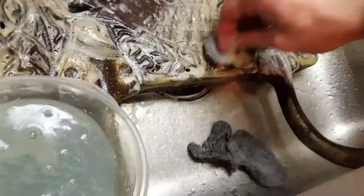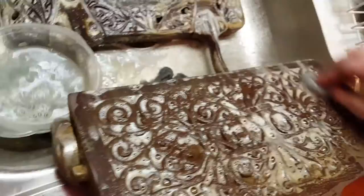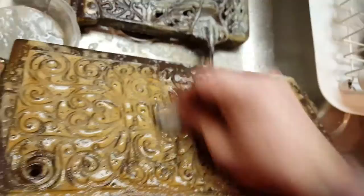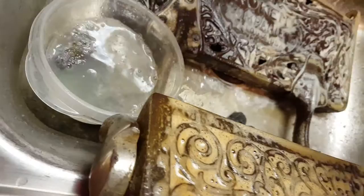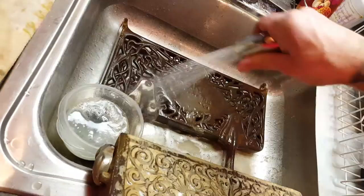This is a whole huge piece and unfortunately I can't take it apart because I don't have any tools right now — all my tools are at the shop and the barn. I'm just giving it a real quick once-over. You can scrub it as well as you want, but you're really just wasting elbow grease if you keep scrubbing for no reason, because this stuff is going to kind of do the job for you. Two times will get most of it gone, third time gets the rest. I'd say usually within three times you're fine, and naval jelly only takes about five to ten minutes.